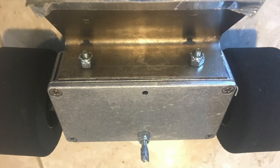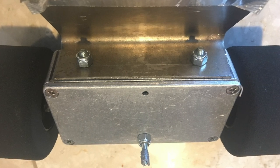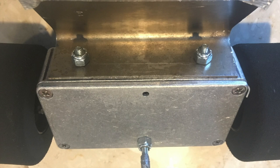What type of weapon does this robot have? It's a wedge — a boring wedge. I had a piece of steel lying around which is a little bit rusty, but after some cleaning it looks pretty alright. I originally tried using epoxy to hold the wedge to the robot, but it fell off really easily, so I cut a longer piece and, after bending it to an appropriate angle, screwed it in using a couple of screws and nylocks. It holds on great and scrapes the ground well.